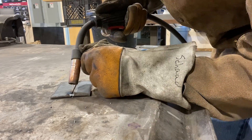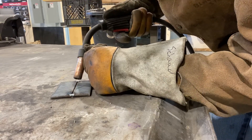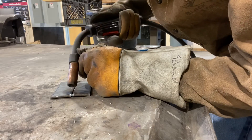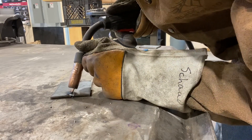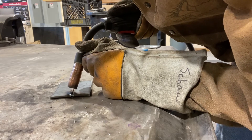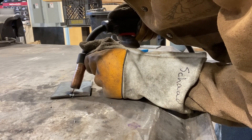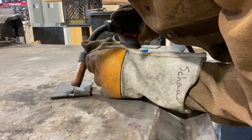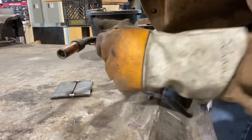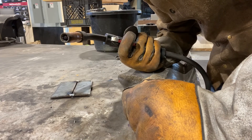Another thing I want to mention is my position. I'll be straightforward with my path of travel. I will not be tilting my MIG gun at a 45-degree angle — instead I'll be closer to 90 degrees as I go about welding. You'll also notice I'll have a pattern. It may be a zigzag, a step, a C pattern, or little loops as I go across my metal. It really doesn't matter — it's just a matter of the welder's preference.